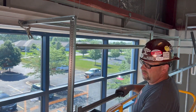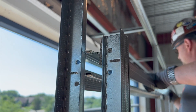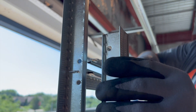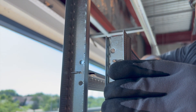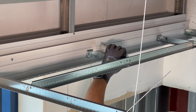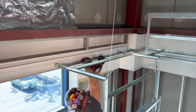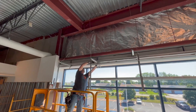You determine with your Armstrong installation specialist where all cross tee route holes are located along the Simple Soffit main. In doing this, you can easily lay out your soffit for special conditions like diffusers and lighting. To maintain two foot on center attachment to the perimeter, we are stubbing in cut cross tee pieces between our four foot on center Simple Soffit frames.